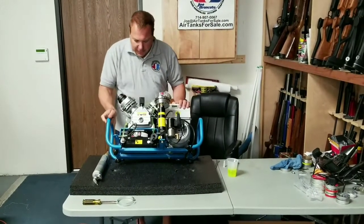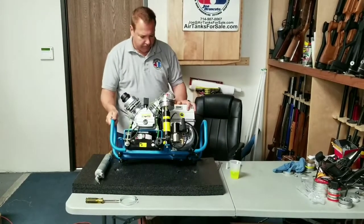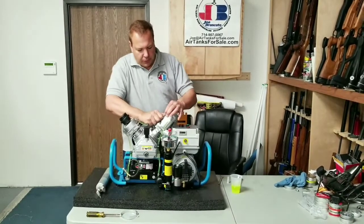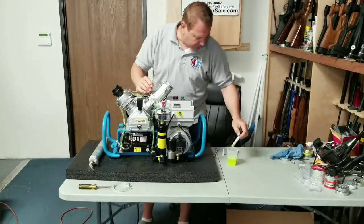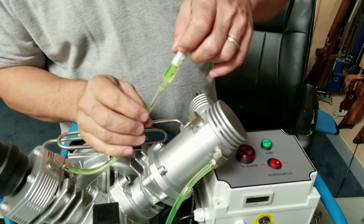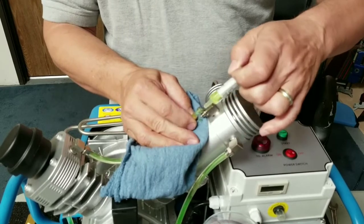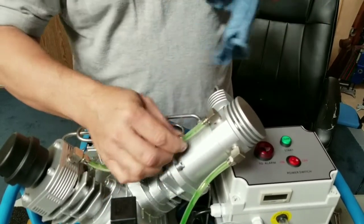Give it a break. Let the air come up out of here and bubble up out of the radiator, because these are the high spots. When I did that, all the air bubbles came out. So we just saw when we tilted it, we got a little bit more air bubbles. You got to pull the hose off gently — and it's on there pretty good. Then you just go like this; I'd stick a rag here and fill it up until I started seeing liquid coming out of there. There we go, now we know it's pretty much full.